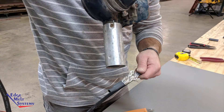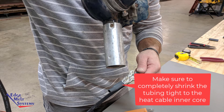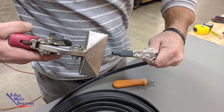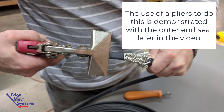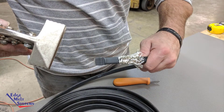Using an electric or propane heat gun, heat evenly all the way around on the inner end seal until hot melt comes out of both ends. Using a handbrake, close off the end of the inner end seal, holding it for a count of 20 seconds. Alternately, a needle nose pliers or bull nose pliers may be used to close this off. A properly sealed inner core end seal should have hot melt squeezing out the end.